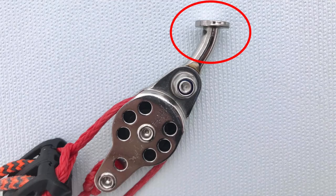My final hardware upgrade is the kicker key — I use a thicker version. The standard version that comes on most boats is thin, and the issue is they can bend and then break under excessive kicker loads. Using this thicker key allows me to have real confidence in my kit.